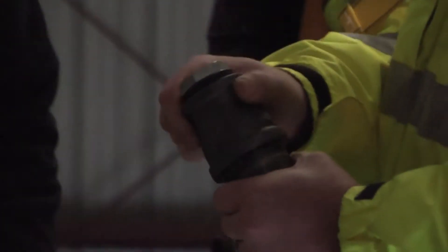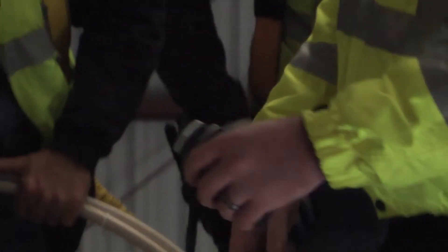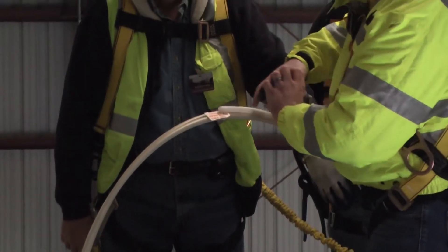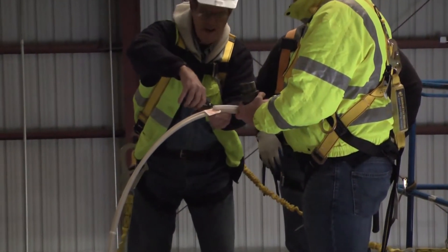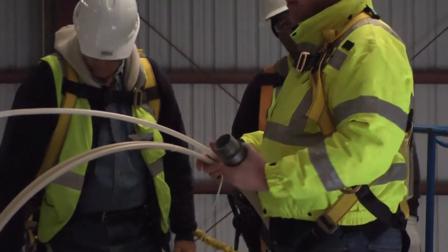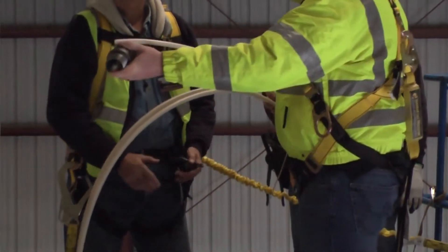They made this reducer device — it's going to screw into one of the bungs on the tank and give the ability to support the probe. As we were talking about before, you can see it has this three-quarter inch opening here. This is going to slide on the probe from the bottom, upside down, all the way around as you're putting the probe into the tank. We want to cut this connection here. Cut only the first wire tie in order to assemble the hardware on the end of the probe. Make sure you slide the fitting on so it's going to end up right side up.